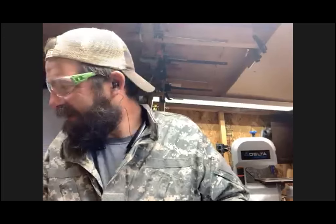Most of it was the detail gouge, and some of it was skew, but I couldn't tell you exactly how I did it. A little fine turning, when you master the line and figure out how to do slicing cuts with a skew, that's where you get that. In my opinion, it's not rock solid. I'm getting better at it, but it's still a work in progress.